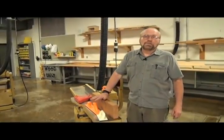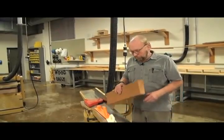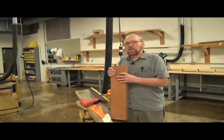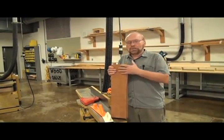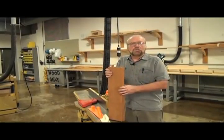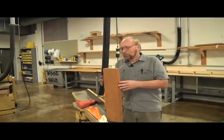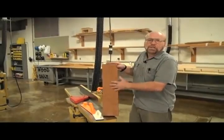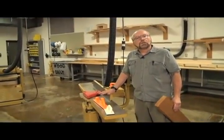Today we're going to be doing some fine woodworking, and the key thing about doing woodworking is that the wood stock that you use has got to be a rectangular solid. It not only needs to be smooth, it also needs to be flat, the edges need to be square, and all the faces need to be parallel to one another. So for our lesson today we're going to look at how to get one of these faces flat, and to do that we're going to use this machine called a jointer.